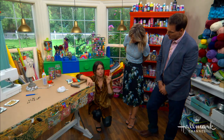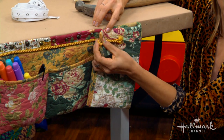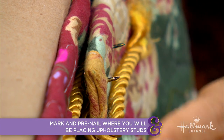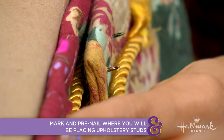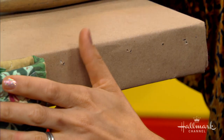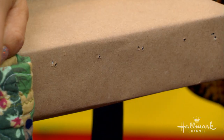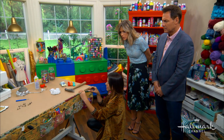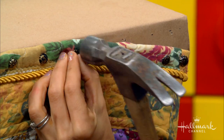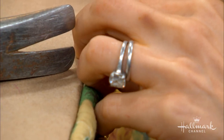When you're doing the upholstery studs there are two things I really recommend to make it much easier. One is you want to pre-pierce them through - I've poked these through already. I measured along the way, taking my measuring tape and going an inch and a half apart to make sure they were all even. On my table I did the same thing - measured one and a half inches apart and then took a tiny little nail and hammered it in to pre-drill the holes. Otherwise when you're pushing them in and you've got to hold it straight and grab the hammer, it's just really difficult - you're going to hammer your finger. This way you've got a little area to push it in and then hammer it into place.